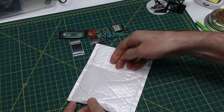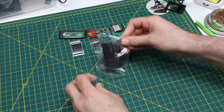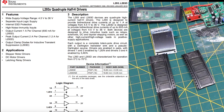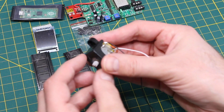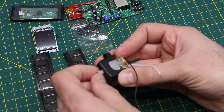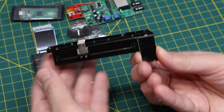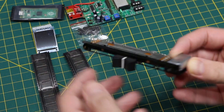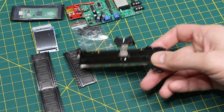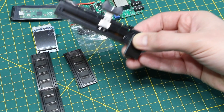It's supposed to be L293D motor driver chips. Looks like it — L293DD. At least I can work on one project. These are quad half-H drivers and they can run relay solenoids, DC or stepper motors. They're often used to run little hobby type DC motors for little robot vehicles and stuff like that. I'm going to try using it to run this DC motor on this motorized slider pot. Hopefully these work and I can finally get this up and running. I bought these maybe four months ago now, so it's about time.